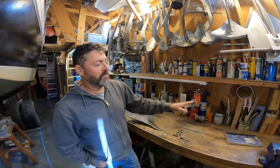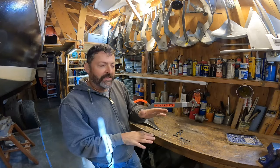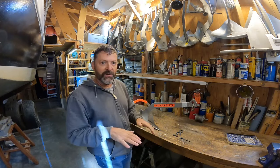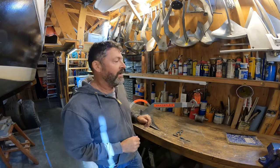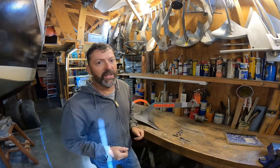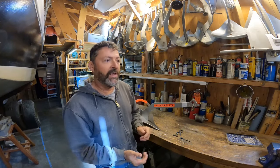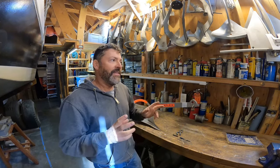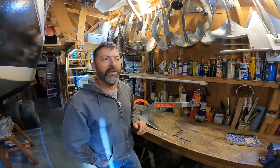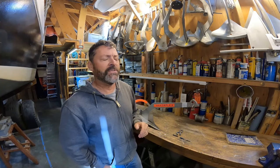A second hole was provided above the primary in order to, in effect, increase the throat angle, or increase the angle at which the fluke is seeing the bottom. Now, it's been my experience with Fortress anchors, which have adjustable fluke angles, and a Danforth anchor, which inadvertently had the wrong fluke angle, that these larger fluke angles really can be a problem and defeat the anchor, make it not work at all in harder, firmer substrates.